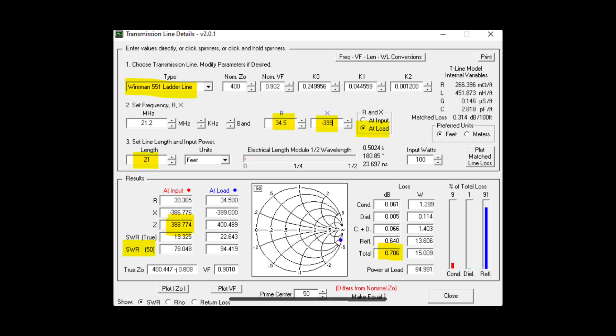This dipole is a little on the short side for 15 meters, but overall in terms of convenience — which is what a multi-band antenna provides above anything else — there's hardly any trade-off in performance. This antenna takes very little space. You just need to run the ladder line as close to 90 degrees away from the antenna as you can; it can slope down a little and that won't be an issue. You also need a messenger line to keep the pole upright. It'll probably tune on 17 meters as well and might even work on 20, but I focused on 10, 12, and 15.